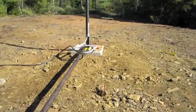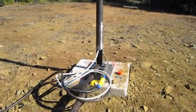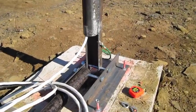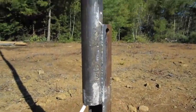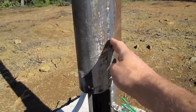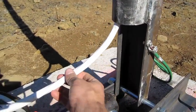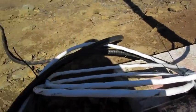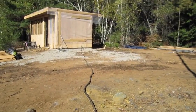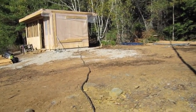The base of the unit has what we're calling a riser box. It's a bunch of angle iron and the pipe sits in the angle iron here. It leaves space for the three phases to come through, and then the wire runs into the shed where we have the charge control system, which I'll show you in a second.